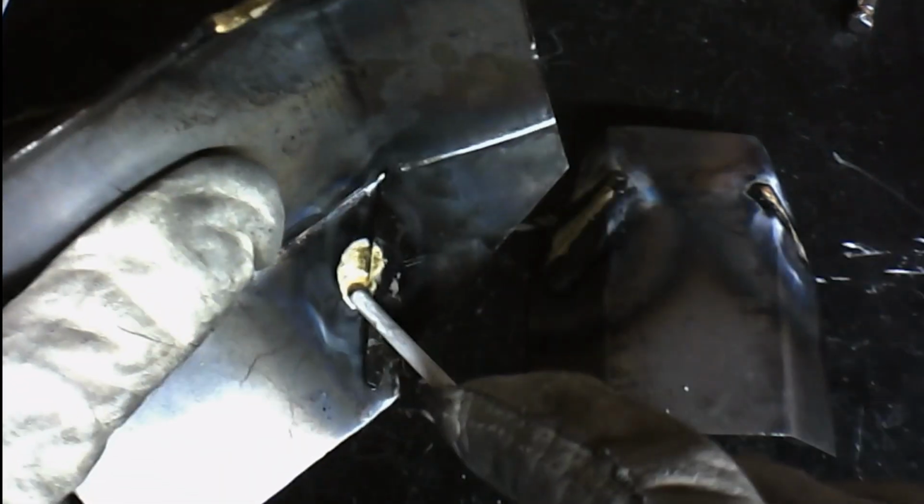And then on the back, we have our one singular small tacked area, just as a support tack. Same on the other side, just our little support tack. And then again, we've got about a 1/4 inch width welded area here, nice fill in, and we know that the braze has spread to both sides of the metal. That constitutes a perfectly welded joint at that point. That's how we know it's welded properly.